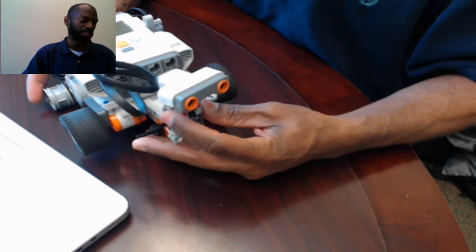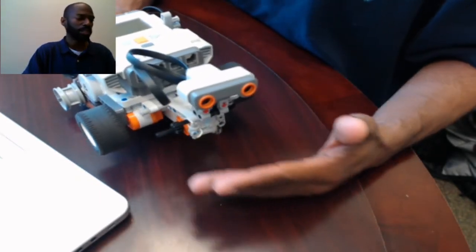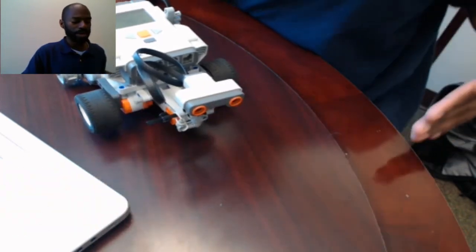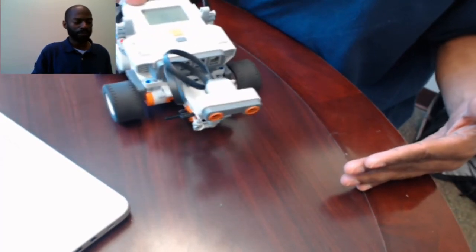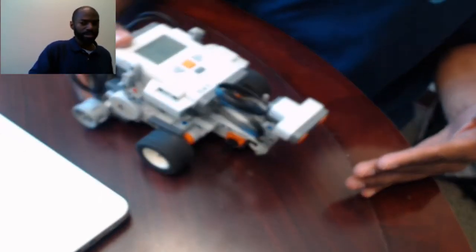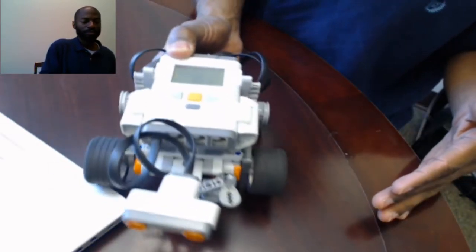The added benefit of making an oscillating back-and-forth motion is that you can cover a wider area in front of the robot, find out which path is clear, easier and quicker, without having to actually have the robot stop and then scan. The robot can continue going straight while the ultrasonic sensor is scanning back and forth, and then make path corrections accordingly. There are other ways to do obstacle avoidance, but this is just one of many.